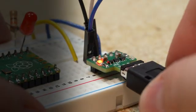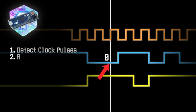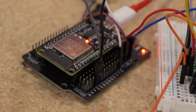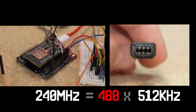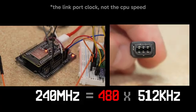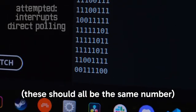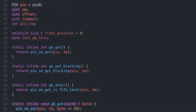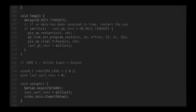With a PCB that at least seems to be working electrically, we need a microcontroller that can detect pulses on the clock line, read whatever is on the receive line, and set the transmit line to whatever bit is next to be sent. I figured the ESP32 would be up to this task, running at over 400 times the speed of a Game Boy Color. But comparing speeds like this can be deceiving. I tried several different methods and was only able to recognize signals up to maybe 200kHz with the ESP32 — less than half of what we need. Now, is this because my code is entirely unoptimized and I only have a rudimentary understanding of microcontrollers? Almost certainly.